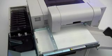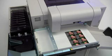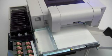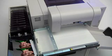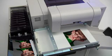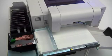Printing 10x7 saves an inch of media per print versus the traditional 8x10 print unit. For media up to 8 inches wide — including 4, 5, 6, and 8 inches — and up to 12 inches in length, the prints will convey to the right and utilize the 10-bin job sorter. Each job bin can hold up to 50 prints, which is convenient for keeping prints within a job together. To sort together, all prints must be of the same size and sent as a continuously batched file. Please note: the green button on the front of the 10-bin unit will jog the sorter one bin forward when pressed.